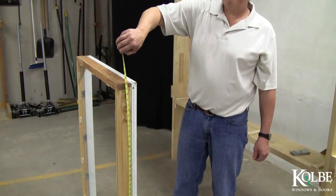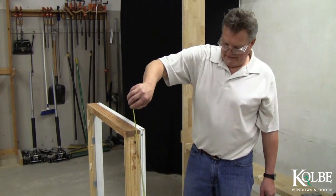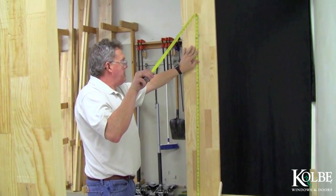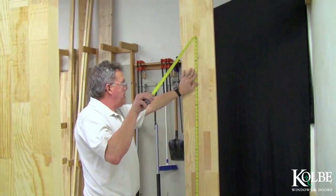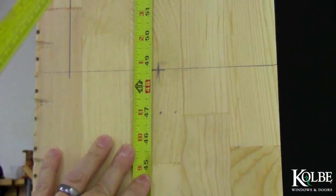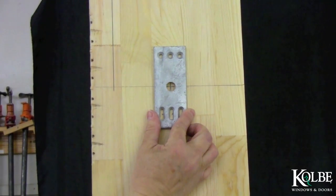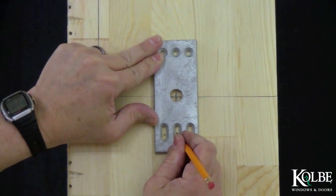The first step is to determine where to locate the anchor plate in the rough opening. To determine where to locate the anchor plate height and depth on the vertical of the rough opening, see the installation instructions packet for specific details. This will vary due to the steel mull thickness being utilized and the overall size of the units being mulled.